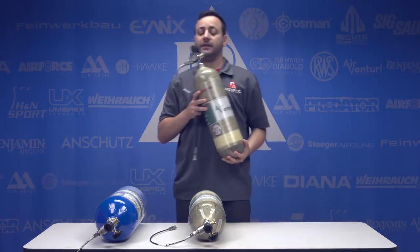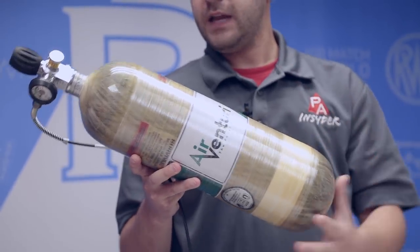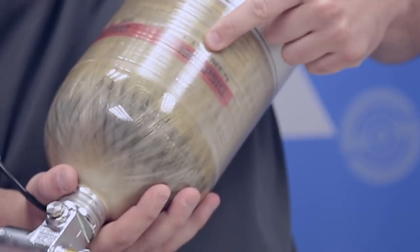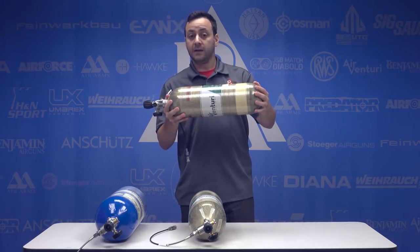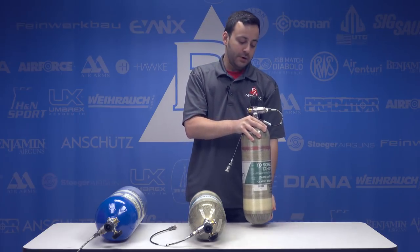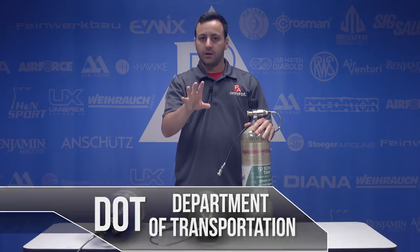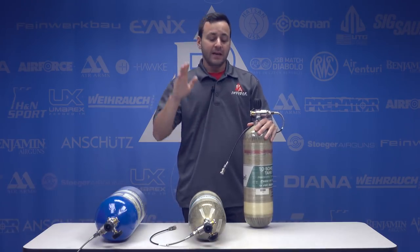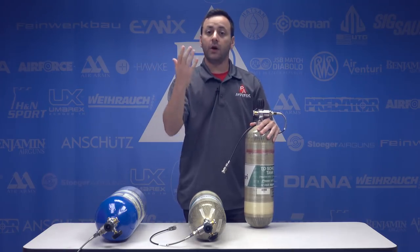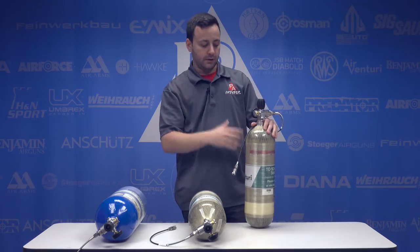These are life extended tanks — standard carbon fiber tanks at 4500 PSI that have run out of that first 15-year period. This tank here was originally made in April of 2000, so it basically expired for DOT purposes in 2015. About a year and a half ago, in 2017, a company called Digital Wave in Colorado was granted a DOT special permit to life extend tanks through a very stringent process. This gives tanks up to an additional 15 years of life, so this tank made in 2000 is good until 2030, assuming you take good care of it.